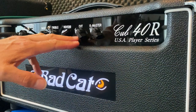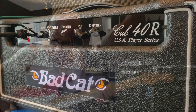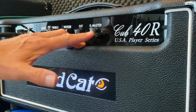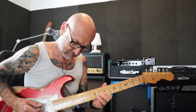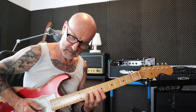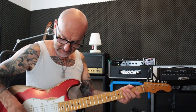This is way too much presence for me, but yeah, it's still not making your ears bleed. If you turn the preamp totally fully up, you can sort of tame the total volume with the master. This is the 12AX7 without the fat boost — and then the EF-86. For a single channel amp, that's quite impressive.